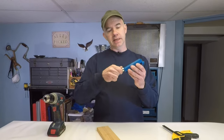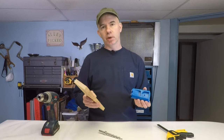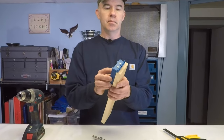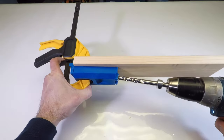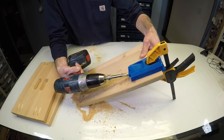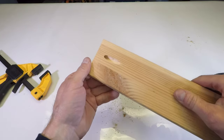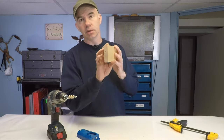For those of you who have never used a pocket hole jig, it's really pretty simple. It has two holes and a special drill bit. The drill bit will get drilled like so and has an automatic stop. This is only the part that gets drilled into the wood. Simply place the pocket jig on the end — it will automatically stop. Take a clamp, it'll hold it in place. It automatically stops right there, pull it out. So what happens is our screw will get inserted into this hole and it will remain hidden on the underside of the stool. It's really pretty cool.